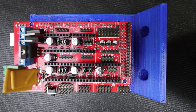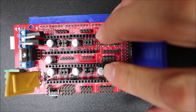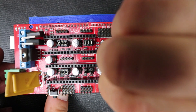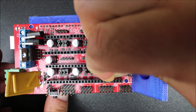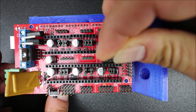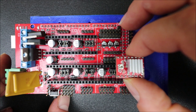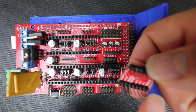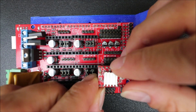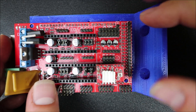Before we start connecting the jumpers, the pins are empty still. Having all three jumpers on the RAMPS board gives us the highest degree of microstepping. The first one is going to be our A4988. We find where the enable pin is and match it to the enable pin location for the Z axis port, apply a little pressure, and now it's in place.